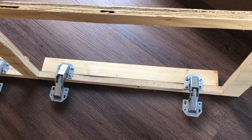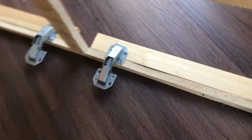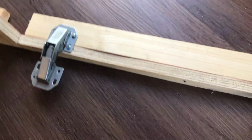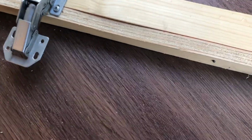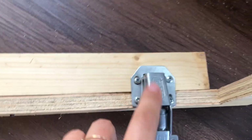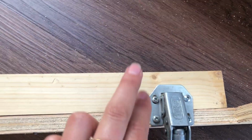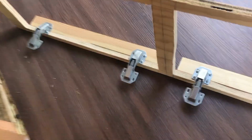My brother's been helping me do the cabinets, and he's doing a quick smoke break, but I thought I'd show you a little update. So this is going to be the face. Of course, it's all drawn on from the front side, but that'll be painted. But since this plywood is far too thin and I wanted to have a good anchor, I added these 1x2s. So there's a second point for these to screw into. And I did that also on that one. That's going to go over the bed. And yeah, nice and sturdy. So next we're going to actually screw them on.